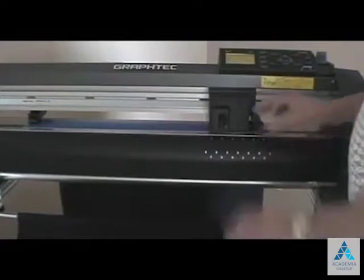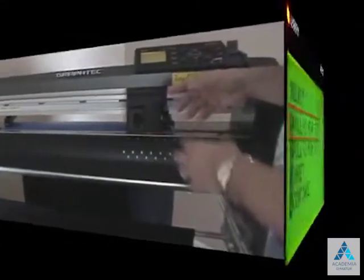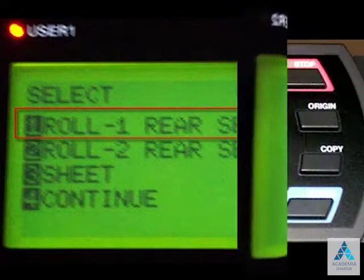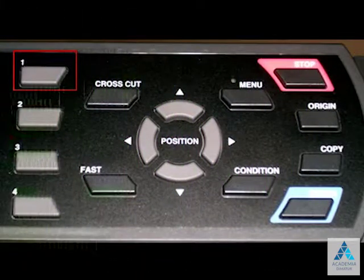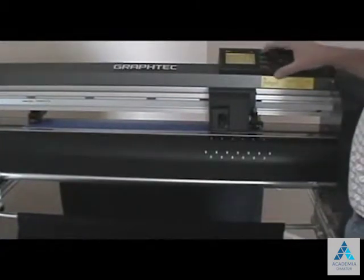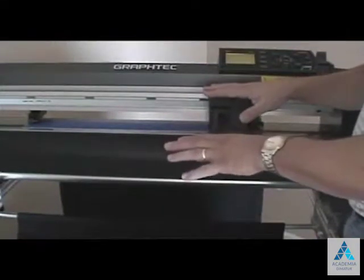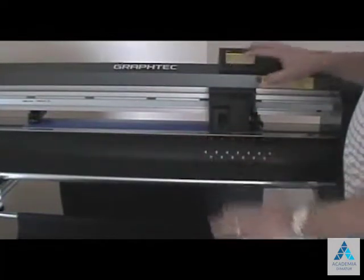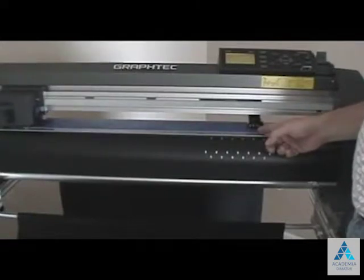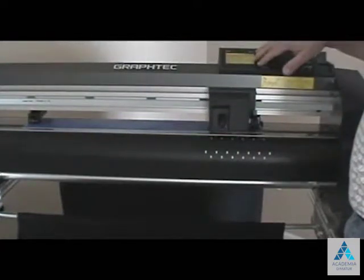What we're going to do is I've got the vinyl loaded in here and I'm going to push back this lever and then set it down. What that does is reinitialize the cutter. Up here I've got some options. Number one is roll one rear sheet — that's what we're going to do. When I press number one on the control panel, it will initialize and measure between the push roller and the one on the other side, pull the vinyl over the eye, and set it so it's ready. The panel is now ready for cutting.